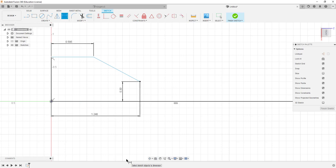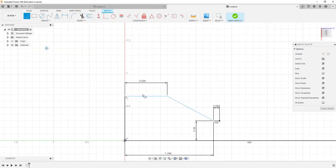Looking at the other parts of the Knight, I can see I'm going to need a small land that runs across here, about 84 thousandths long. I'll draw it in and dimension it at 84. Now I'll pan over and put my little V-groove in — I want you to do a quick modification to the V-groove just so it'll be smoother. Apply dimensions: here to here is 0.084, and the next dimension from the bottom is 0.182, taking care of both sides.